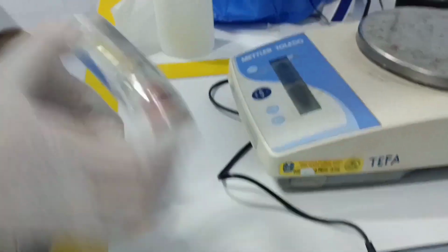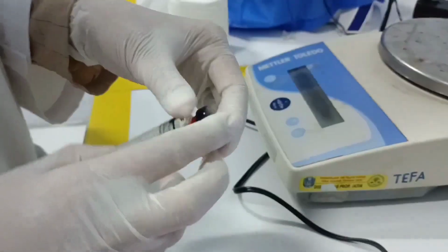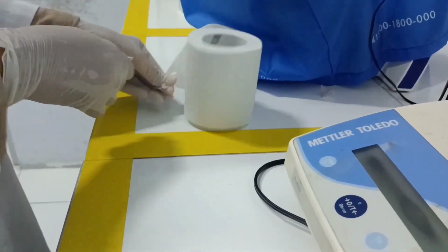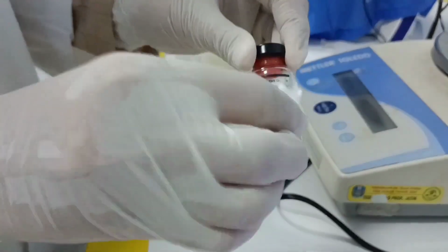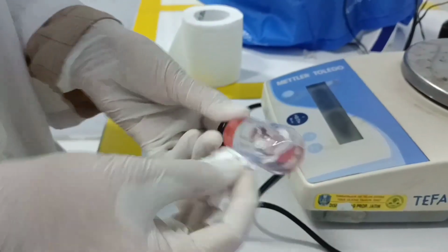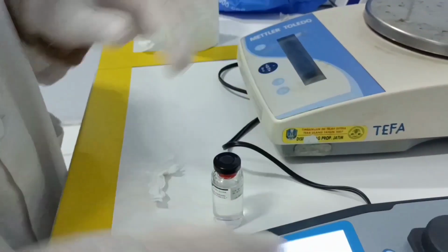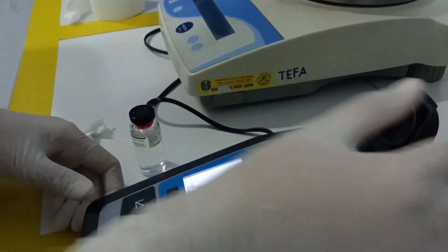3. Measuring the turbidity value using a turbidimeter. Before measuring the sample, calibrate the device and clean the cuvette with a tissue to avoid affecting the results. Measuring the turbidity is important because it indicates the level of clarity of the water.